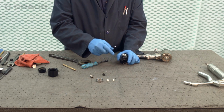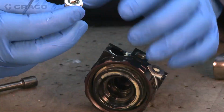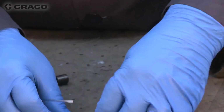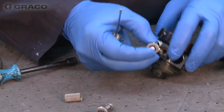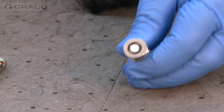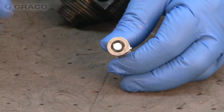So we have the inlet check valves and screens. There's a resin side and one that's not marked. And then we have the ISO side, or the A. And the A side components, as you can see, they're all marked A. They're machined the same. The only difference is we label them. We want to keep the parts separate.